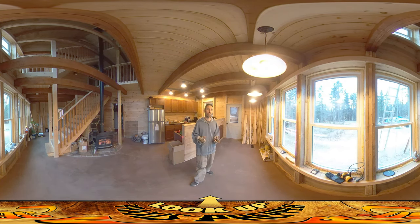One thing I'm going to do is eventually put a timer on that vent — maybe have it go intermittently, like half an hour venting, half an hour off, and so on. We could use half as much electricity that way, and I'm going to keep using the meter to figure out exactly how much I can turn it down without there being a negative impact in here.